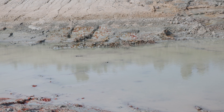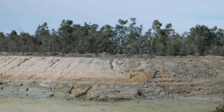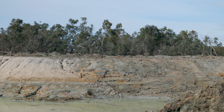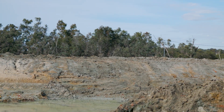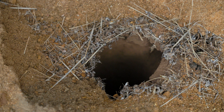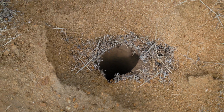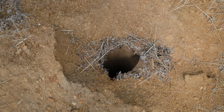How do you actually start out accounting for seepage? What are you looking for? If there's seepage, it's usually down fairly low in the dam, but I would have already located that in the drilling. The water will actually come into those boreholes, and that's where I'm pulling a sample out. So I know that it's there.